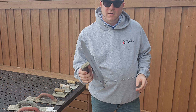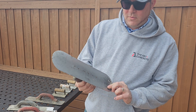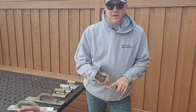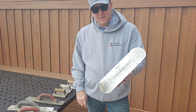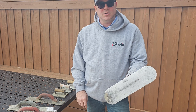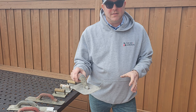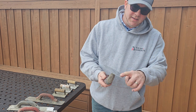And then you have a steel pool trowel like this. This is used for indoor concrete slabs such as floors, garage floors, things like that. But do not use the steel on an exterior broom finish or stamp project because it will delaminate the surface. It won't allow the concrete to breathe because you're sealing it up.